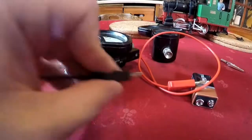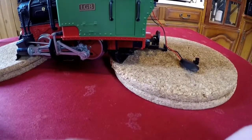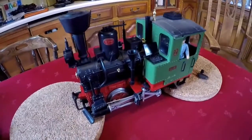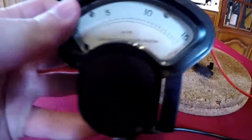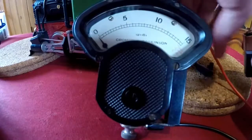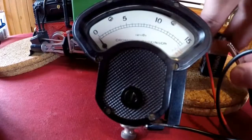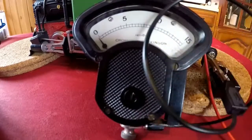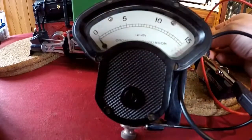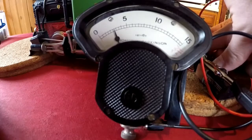With those locked in place we will attach a crocodile clip to there, and I shall move you across to our test load. It's a standard G-scale railway engine — fairly low current draw. This is the one that they include in all the starter sets and I would strongly recommend it if you have any interest in that direction. So we will prop our test meter up so you can read it, connect our battery to the socket on the back of the locomotive, and connect this to our battery clip. Any electricians look away now — I'm well aware, but this is very low voltage, we should be safe enough. And there we go. That appears to be measuring a little shade over half an amp, which is probably about right.